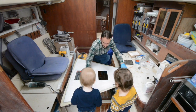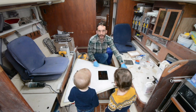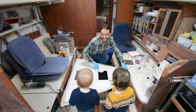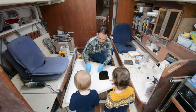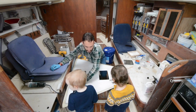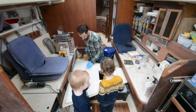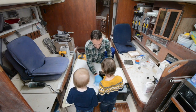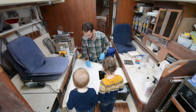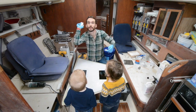Okay, so I'm just going to give this a quick wipe with the xylol because I want to get rid of some of the initial waxes that are starting to form. This isn't necessary, but it just makes me feel better. And if there is any little wax that has been forming in the curing process, hopefully this will knock it off and allow us to have a nice clean bond between the two layers. Alright. And throw this smelly rag out of here so we're not all breathing it in.